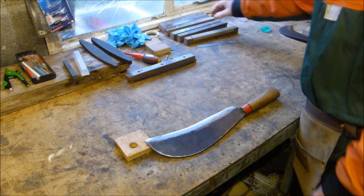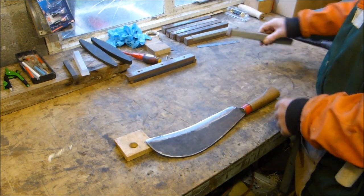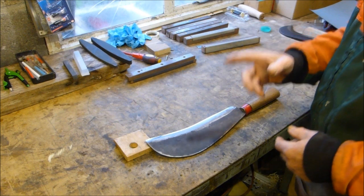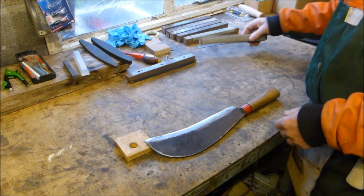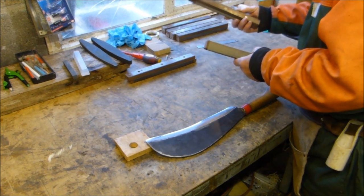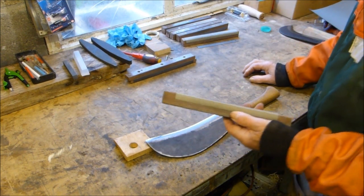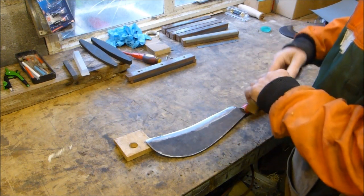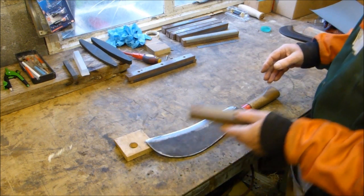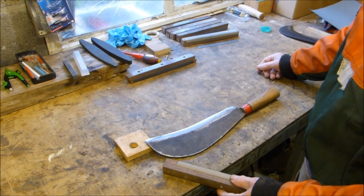So you sharpen it like that. You go through the process. You come to 3000 and you sharpen it like that. What I have got, because with the pack that I had, with all these packs, it had one 7,000 paper. So I made a 7,000 grit, and here it is. This is the one, 7,000 grit. And I thought, well, I'll just improve on that, because it's good enough. That will actually cut newspaper, which people use as the golden way of determining the sharpness.